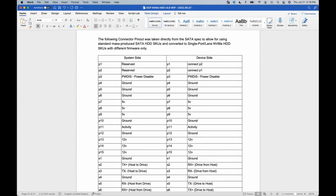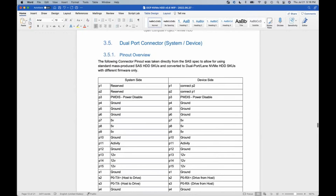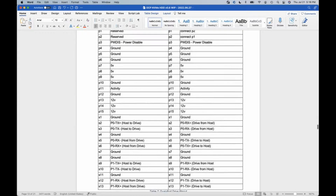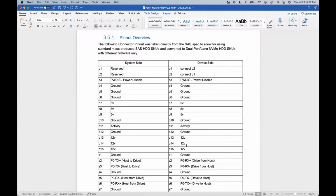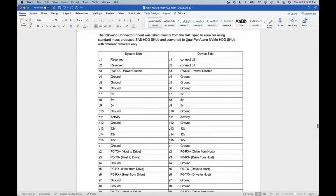All right. Unless there are other comments, we'll move to the next subject, which was the activity signal from both the SATA connector and the SAS connector. We're going to use that terminology. And we're going to have to clean up this dual port, dual lane. We meant it so that you can support either.